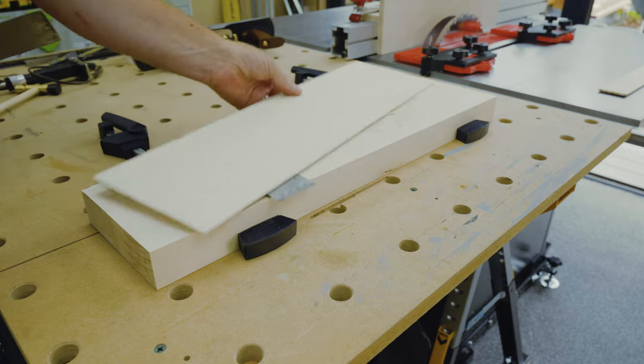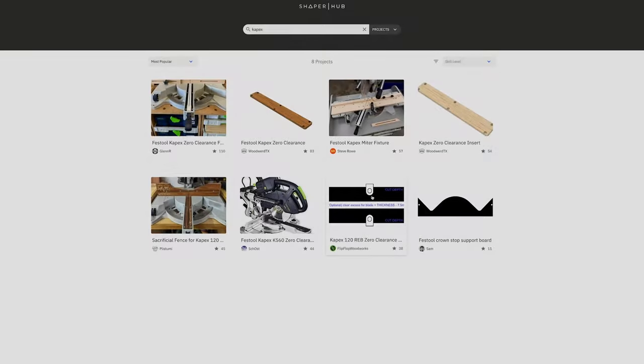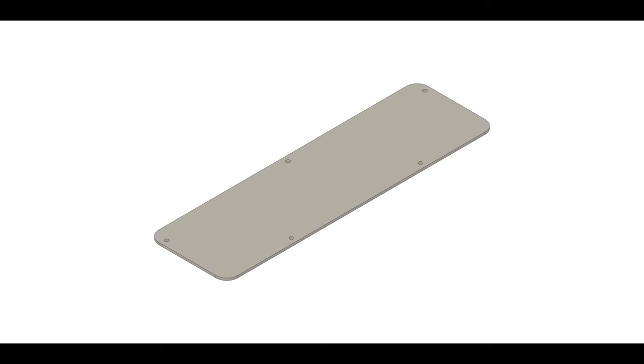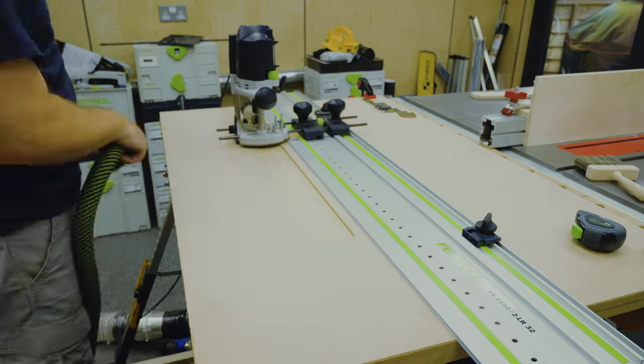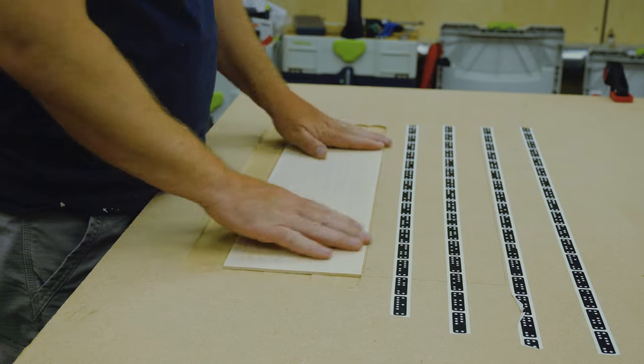With the blanks at target thickness, the next step was to do the cutouts with the Shaper Origin. For the Kapex pieces I downloaded cut files from the Shaper Hub. For the table saw I made a basic model in Fusion 360 and used the Shaper plugin to send to Origin wirelessly. I set up my sacrificial MDF board and resurfaced it with the router so that my first blank would be on the same plane as the Shaper Tape.